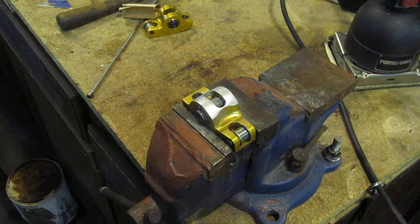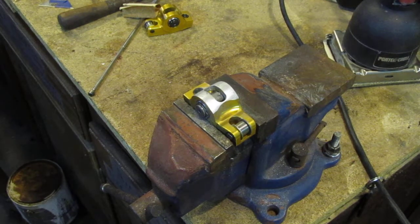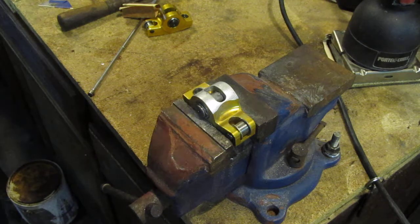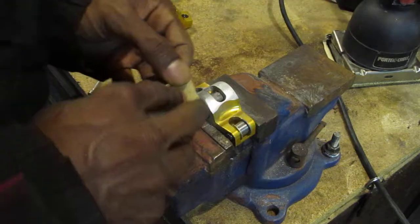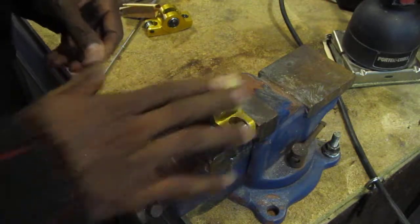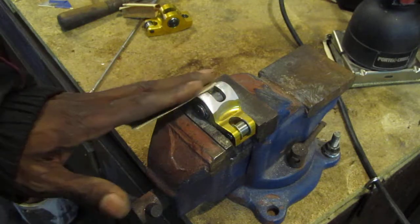The camera got caught up with the vacuum but I'm back on. Now since we sanded it with the 80, I go over again just to make it smoother with some 120 — just to get those deep scratches out.